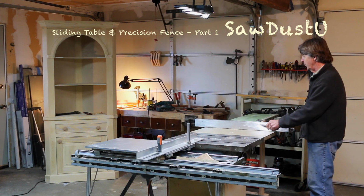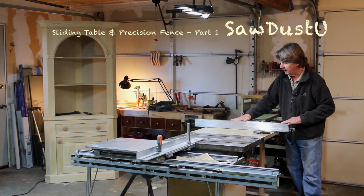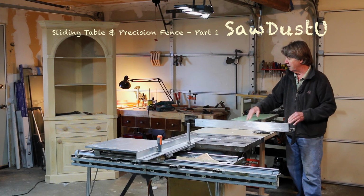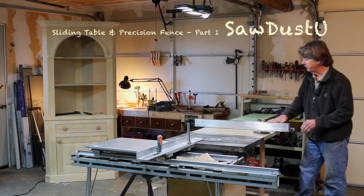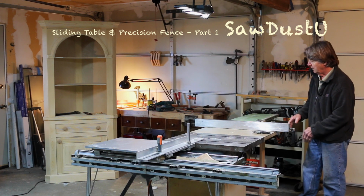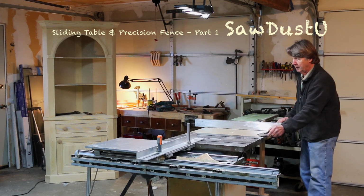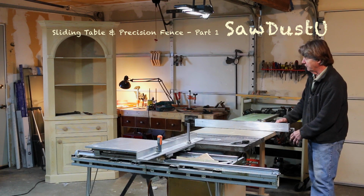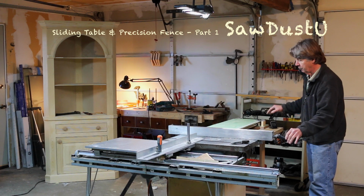I designed this one for this saw, so I have a 36-inch fence, but the nice thing about this when you build it yourself is you can make it as long or as narrow as you like. My other saw, I had one that was 42 inches because it was a slightly bigger saw and a bigger top, and I wanted the support as I run my pieces through. But this works great for this saw, and it'd probably be about right for most homeowners and small shops, 36 inches. It's got the guide rails here. You see, you can move it with one finger.